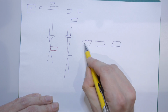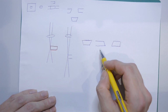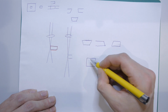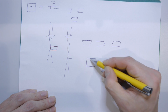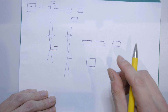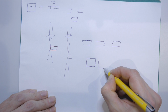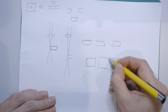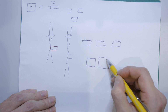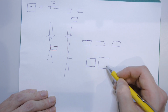And you can see our piece would fit into here perfectly. But we can't use the same cutting path for the hole and these inlays here. For example, when this is a cutting path for our hole, then our inlay should be a little bit bigger. I said a little bit, but to see it better, I draw a little bit more. So this will be our hole, and this, in an extreme way, will be our inlay piece.